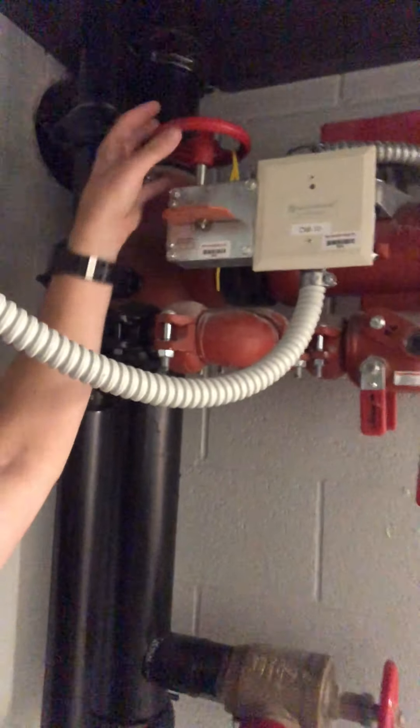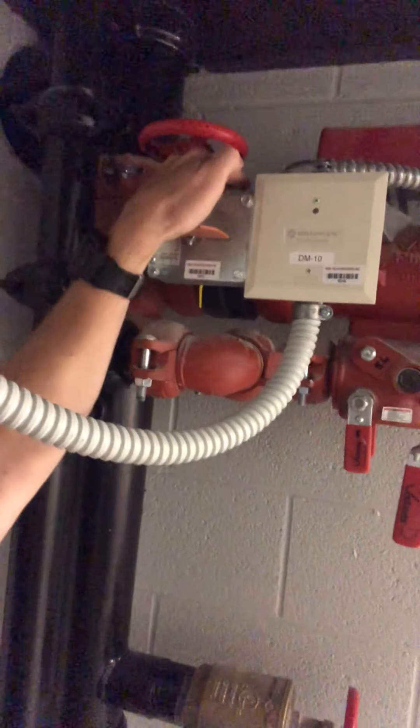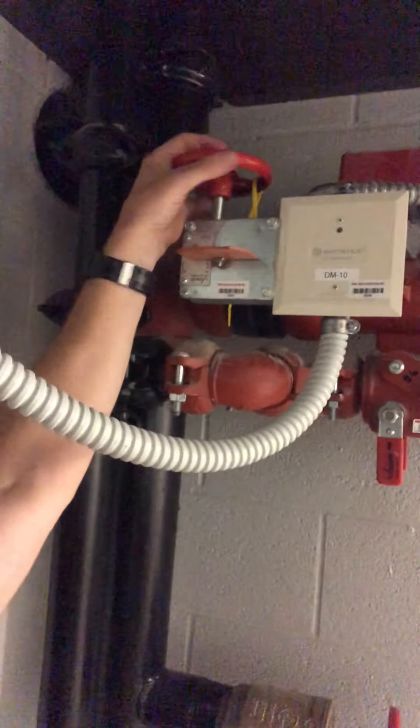So I can isolate this valve — it's obviously in the normally open position. You can see there's a tamper seal to keep people from messing with it, but if I want to shut this valve off, I can isolate the individual floor. The best part about isolating that individual floor is I've isolated that room or floor where the sprinklers have ruptured, but I keep my standpipe water and I don't lose the entire building.